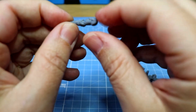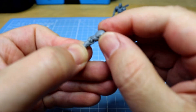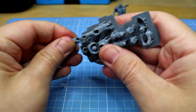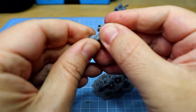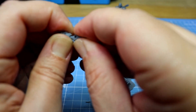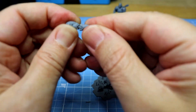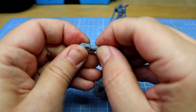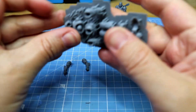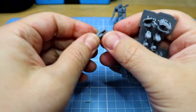The elbow, for example, is a critical part because the cavities for the ball joints are pretty thin-walled. But as you can see, this snapped together nicely — no problem. Let's do the other arm. I'm always a bit careful; I don't want to break them on purpose. It's good to do this slowly, to wiggle in slowly and carefully, just give it time to expand a little. Don't do it too hastily — even with freshly printed resin, even the more flexible stuff can break if you are too forceful too fast. But anyway, this looks good, so let's continue breaking off the parts.